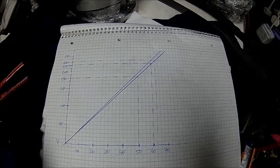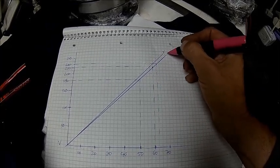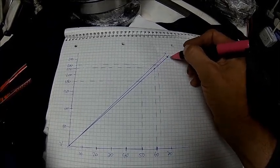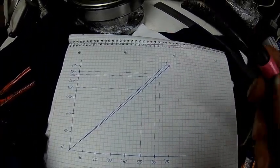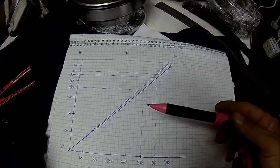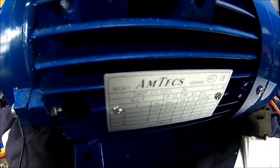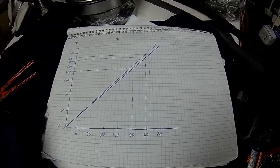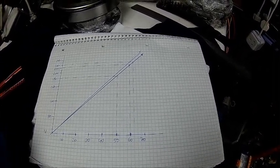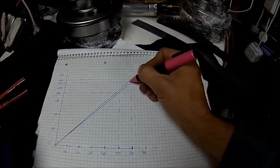Because it's sometimes not easy to understand what I'm trying to explain. We know this motor is 220 volts, 60 Hertz. Forget this line — this is our motor line. This is voltage and this is frequency. So this curve tells us at which frequency we need which voltage, or the other way around. We know one point, which is on the nameplate — that's 220 volts, 60 Hertz — which is this point here: 60 Hertz, 220 volts.